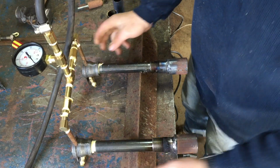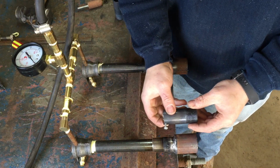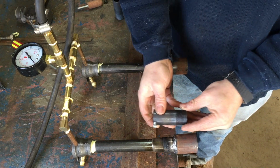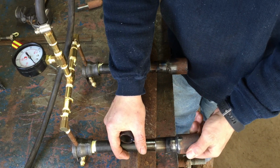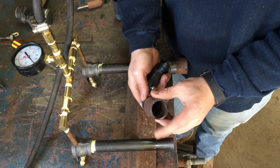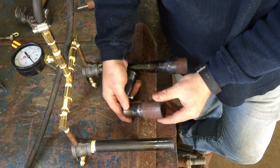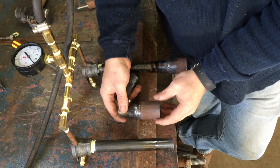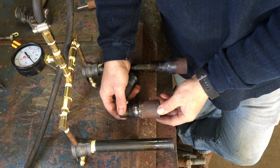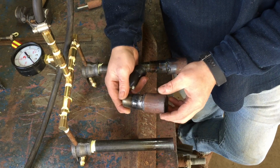Now, on the other end, you'll remember these were just the 1-inch overslots we had. And like I said, you had to find that sweet spot to get that to burn properly. Now, what I've done is, if you remember a venturi was an hourglass, I've taken 1.5 inch pipe, because if you go to the links I provide, they'll say to flare 1.5 inch. If you don't have a forge to do that with, obviously we're building one, but if you have a rosebud, you could probably do it. If you have a welder, you can do what I did.